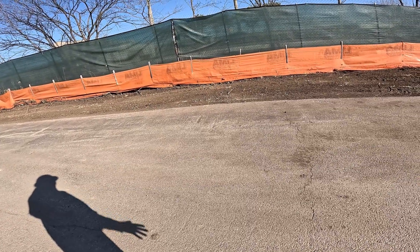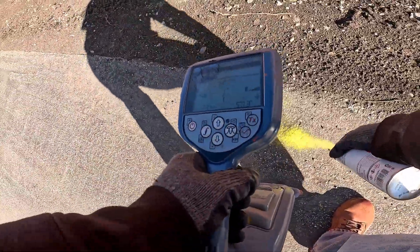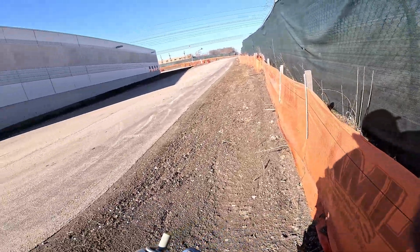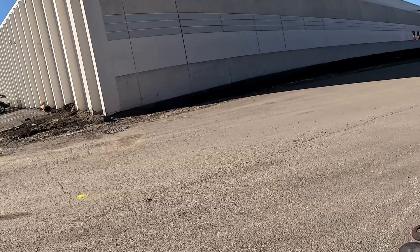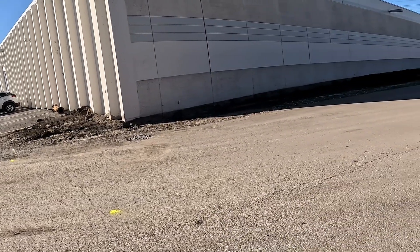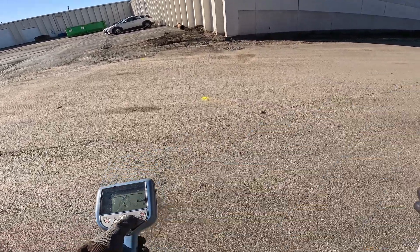It works most of the time. Sometimes you might have one or two bars on the receiver — nothing's perfect in life. So I've dotted out. Now what I'm going to do is verify my peak and null. I'm going to null it back and see if it agrees with my peak. If my null does not agree with peak, I have to troubleshoot the service and find out why my null is not nulling over my peak tone. Most of the time, if it doesn't null over your peak tone, you've bled off into a different utility. Remember that.